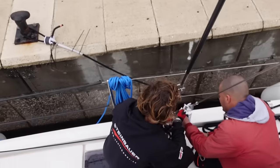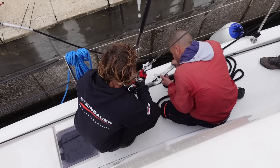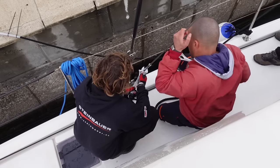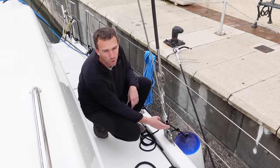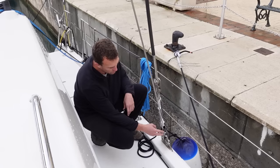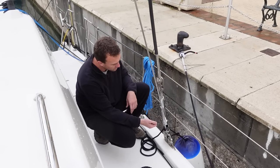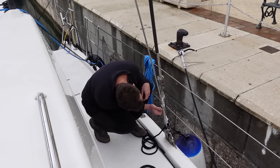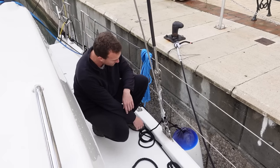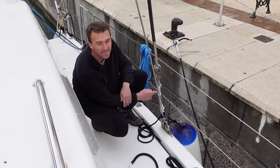Have you noticed how he wraps it in the plastic tape as well? Which they don't do in Cape Town, so they don't damage the coating. So wherever he's going to use a tool, he's pre-wrapped the surface with protective tape. So Jean pre-wraps any surface he's going to work on with tape so that he doesn't scratch the coating, which obviously helps give it resilience in a marine environment. So instead of just sticking the tool on and doing what other people have done and destroying the coating, which then I guess the two metals are going to react with each other and cause corrosion, which is what's been done here. It's damage to the coating on a new boat, which was done in Cape Town.